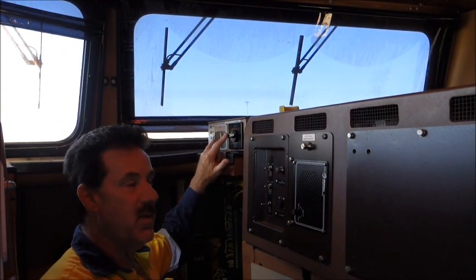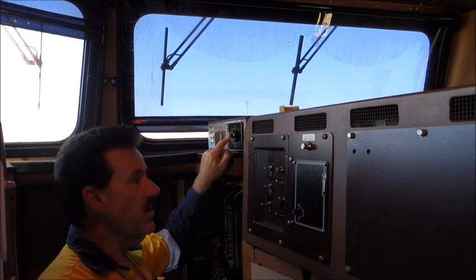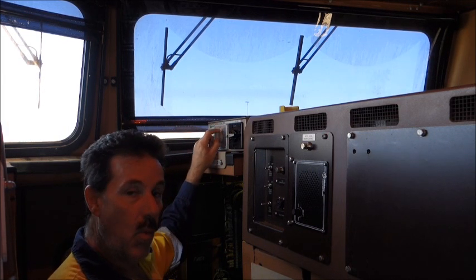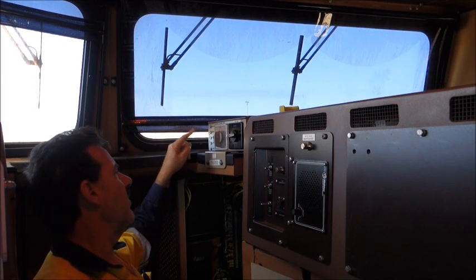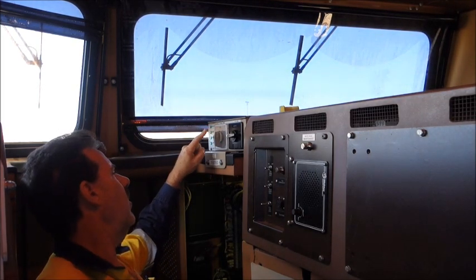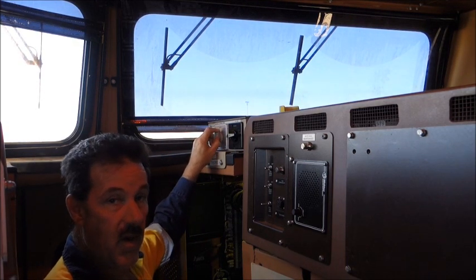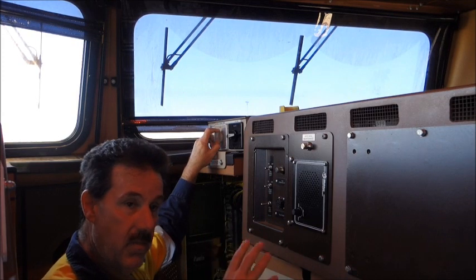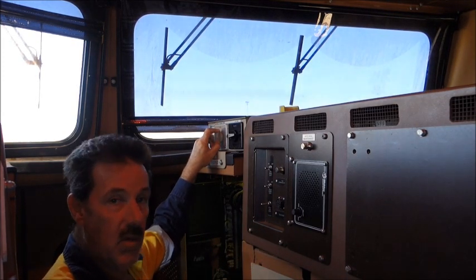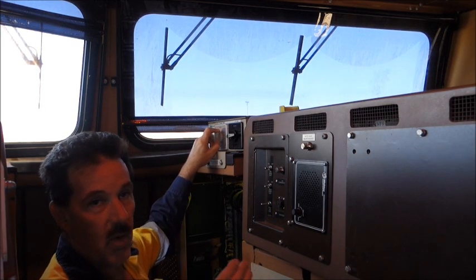These are the ATP switches. This one is the on/off switch and this one is the selector switch for which mode it's going to be in when it's on. We have 'passive' — that's the old system where the driver drives the train. We have 'driver assist' — the driver drives the train but there's a display showing them what to do and when to do it, like 'take a throttle notch now' or 'put some brake on now.' That was the forerunner to AutoHaul during the testing phase.